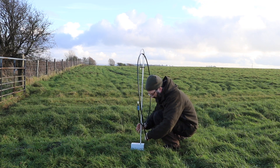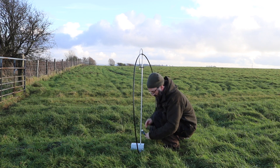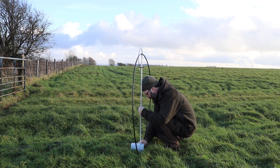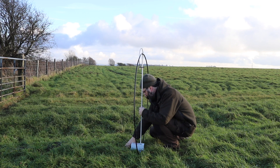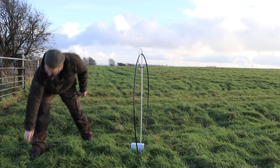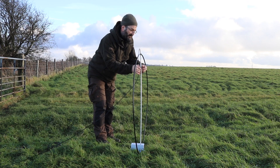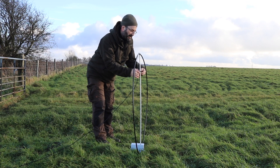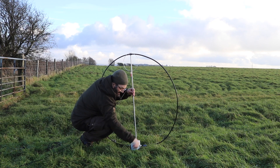The narrow bandwidth has an added benefit though: it attenuates signals above and below you. As with all loops, it can be a struggle to tune the dip to be spot on your chosen operating frequency. I overcome this by using the internal ATU in my radios to overcome any slight mismatch, but this does mean that if you hear a station and want to reply it takes some time to get tuned. An alternative approach when simply calling is to tune the loop roughly to the desired frequency and then rely on tuning the radio to find the dip in SWR.